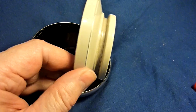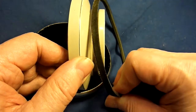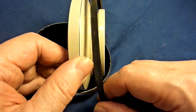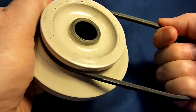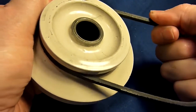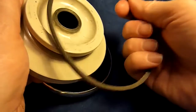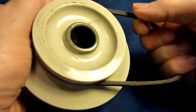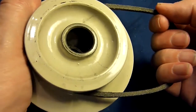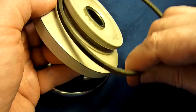I would like you to pay attention to this groove for the belt — this groove has to fit the V-belt you use. This is a 6.3mm or quarter-inch wide belt, and when I put it in and try to pull it, it fits very well and I'm hardly able to make it slip. If I do the same with a 5mm wide belt, it slides very easily in the groove. It goes down to the bottom of the groove and then there is not much friction.